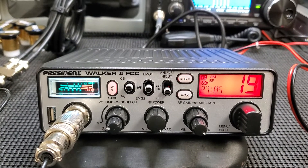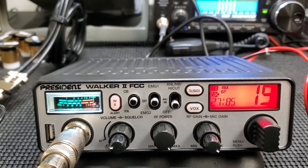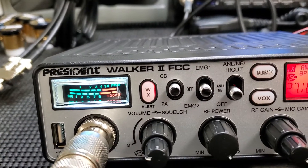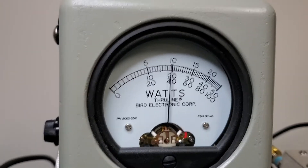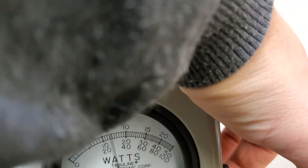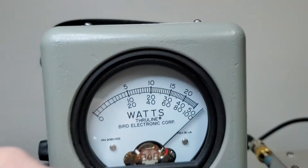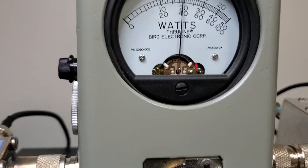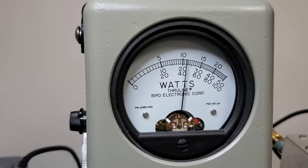Anyways, we're back on the Walker 2 and we got it fully modulated right now with the tone generator. That's the waveform — it looks great. Here's the S-meter on the radio. I'm showing you TX power — this is 10 watts. We're on average so let me put it in peak. Of course it's gonna peg the 10, so let me put the next size up which would be a 25. Here's a 25 — we're like 11 and a half or so, pretty close to 12.